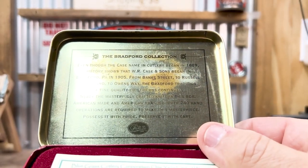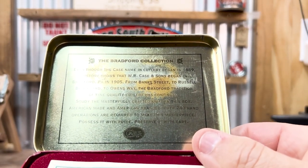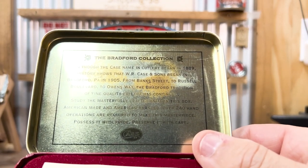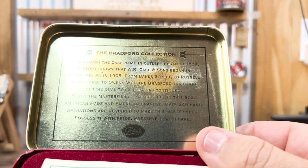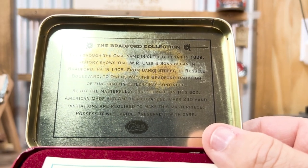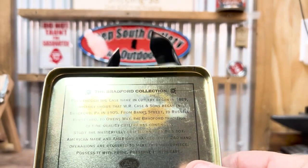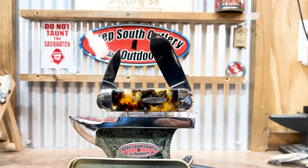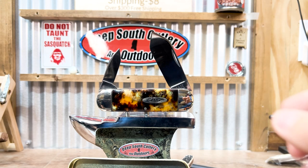This is a result of outgassing from the celluloid material — I'll just call it fake tortoiseshell. The outgassing causes the metal around it to corrode and rust. When we got this out of the box — we bought it from a good friend — he told us exactly what was wrong with it. Simply from being shipped from North Carolina to South Mississippi, this happened.